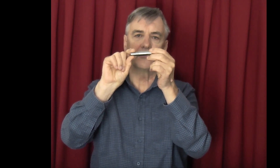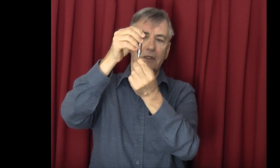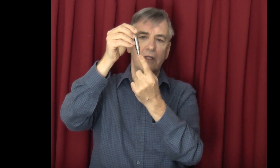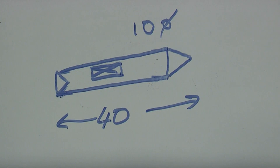Hello, welcome to Enots Engineering. I'm Alan. In today's video we're doing some work on the lathe making a spring loaded plunger which is a tap guide. This side will fit into your tail stock or a collet holder in your milling machine, and then this side goes into the back of a tap. Today we're making a tap guide which is a spring-loaded centre fitted in the spindle of the milling machine or a chuck in the lathe tail stock.